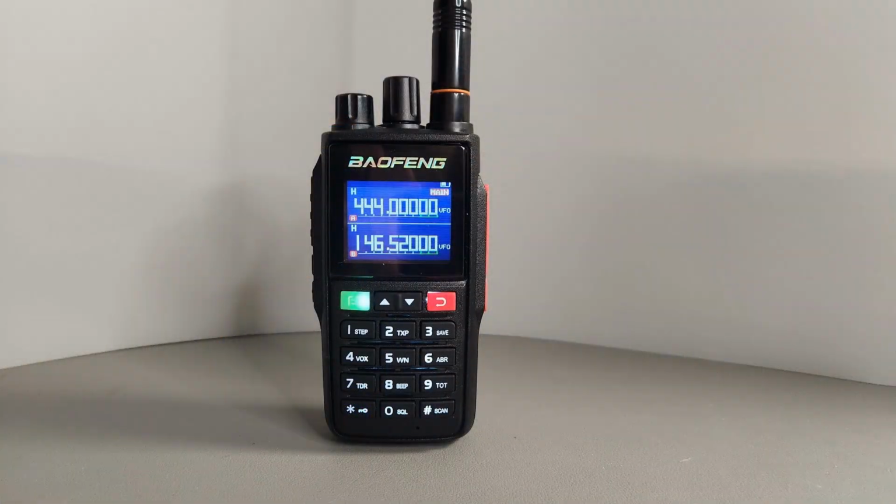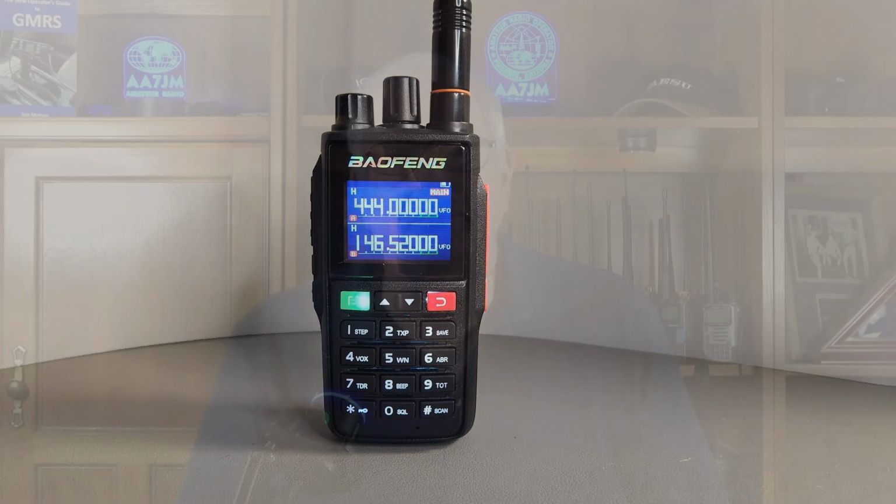As you see, this radio has two knobs on the top, and the band, memory VFO, and AB buttons are omitted. The smaller knob turns the radio on and adjusts the volume, and the larger knob ratchets through channel changes and menu items when in the menu system.